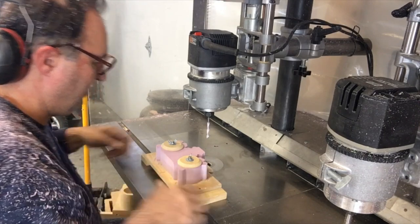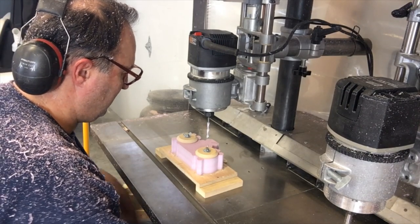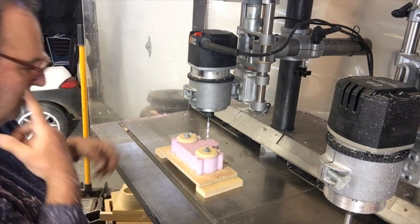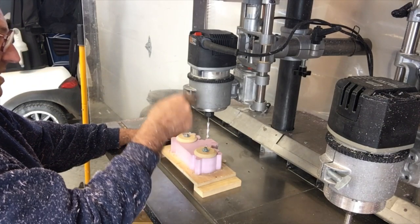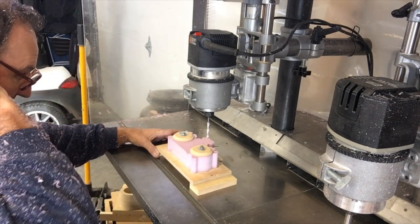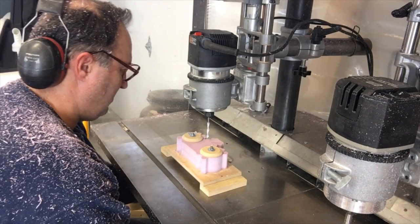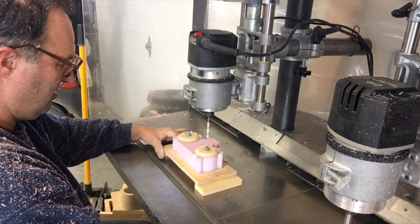can't quite get over the pin. So I'll get over the pin, get into the well. Get back up to the right height here. I think on the next time I cut it, I'll set the router bit up in there a little bit higher because I can't get the pattern up over the pin with the actuator retracted all the way, so I need about another half inch worth of headspace there. But let's see here. There we go. All right, now we're ready.